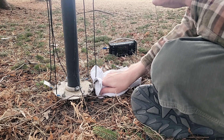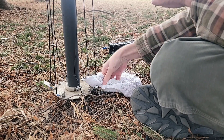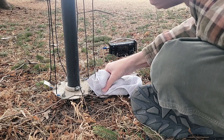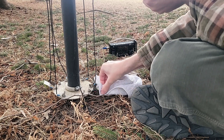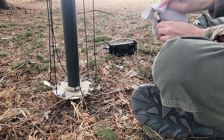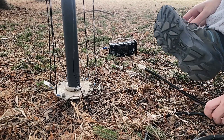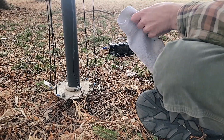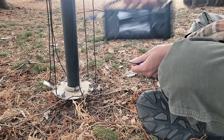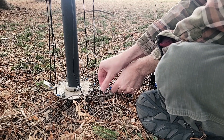So next up, I want to pull the coax out of the mix. I put a little bit of Vaseline on here to keep it weather tight, but that also makes it not a whole lot of fun to touch. I come out here periodically throughout the year and use this coax for other projects, so there's usually a pretty liberal reapplication as time goes on. And I've got my old friend here, the X6100. I'm going to use this to sweep the antenna directly, because it's got a built-in SWR scanner function that works out really well.